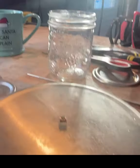I'm trying to think of ways to mechanically trigger a switch when my sourdough starter in a jar rises up to a certain point. But I have no idea how hard it can push before it just kind of doesn't push anymore. So I have a tiny little moment switch here, and I figured out just by putting it on my kitchen scale and pushing down on it a billion times that it takes about 130 to 150 grams of force to activate that switch. So I'm going to make two rigs.